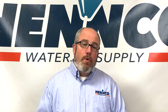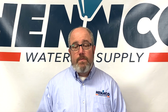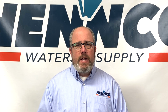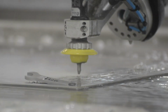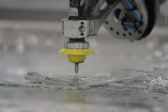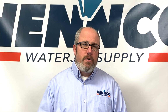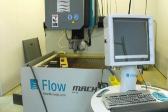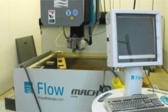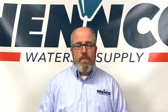Today we're going to talk about pressure, specifically as it relates to cutting outcomes. This is part of our series about the four major factors that can affect your cutting outcomes in abrasive water jet. So when it comes to pressure, it doesn't matter whether you're cutting at 40,000 psi, 60,000 psi, direct drive, Intensifier pump, 90K, does not matter. We need to make sure that the pressure that is set at the system is exactly what we are getting at the nozzle.